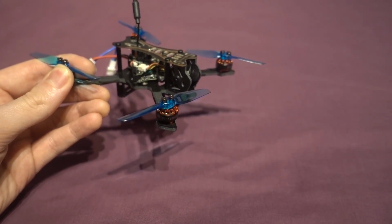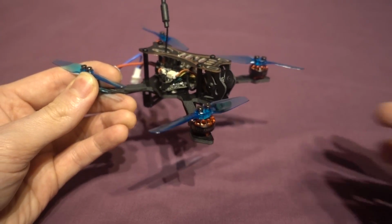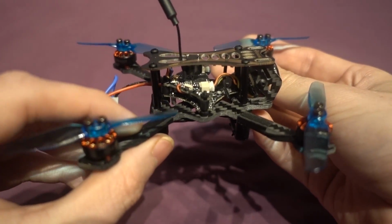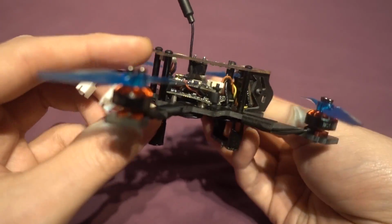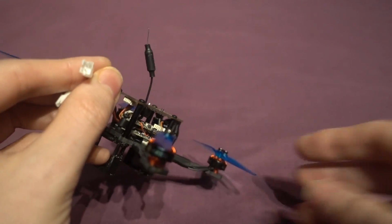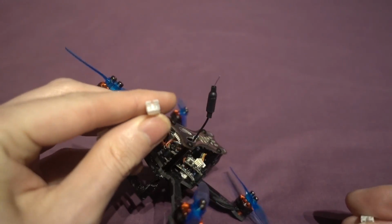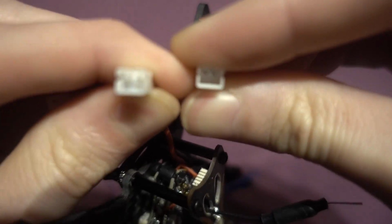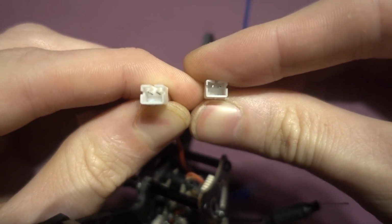Now don't get me wrong, a Crazy Bee V3 board and an XT30 connector would be a better setup than this, but it's a big improvement from the Novice 1, and maybe just changing the open pin PH2 connectors to solid pins would be enough to completely conserve the life of these LiPos.